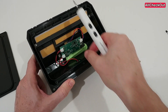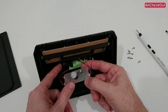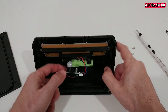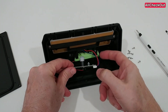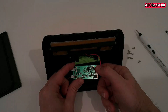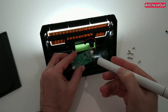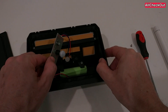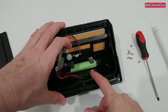So the only things I see here are the electronics with the switch. If we're lucky, we can remove that and do something with it. Here we have the PIR sensor and here we have the on/off switch — that's the thing which we push in from outside with a needle, hitting this switch. For some reason it doesn't work anymore. The only thing this switch does is make a connection between these pins, but you can see it's still working in general, and the battery is also working.